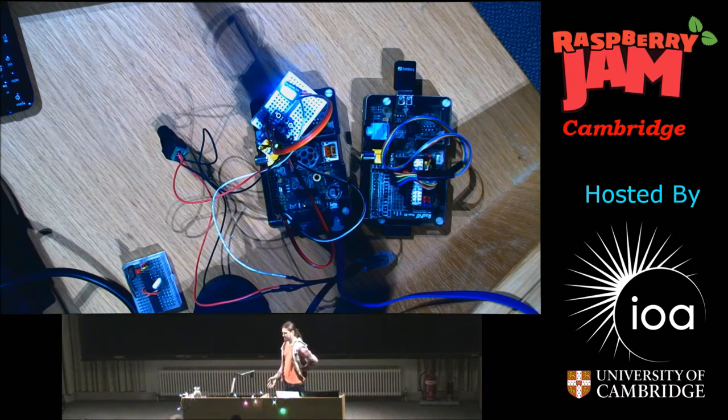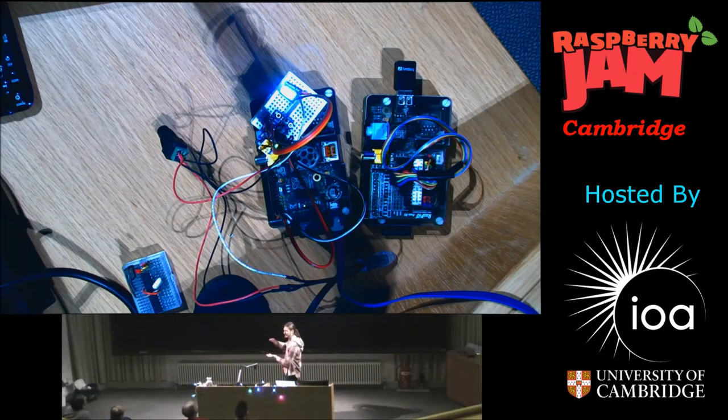If you've got a Raspberry Pi, you might have ten Arduinos surrounding it all doing various different things. If your Raspberry Pi turns off, they can all carry on doing those things. When the Pi comes back on, they can say 'I've been doing this job for the last hour, where have you been?' and report back. That means you can build a massively decentralised system or robot where all the limbs are separately controlled — each Arduino handling one thing, knowing exactly how far it needs to move to reach a position, then reporting back to the Pi.